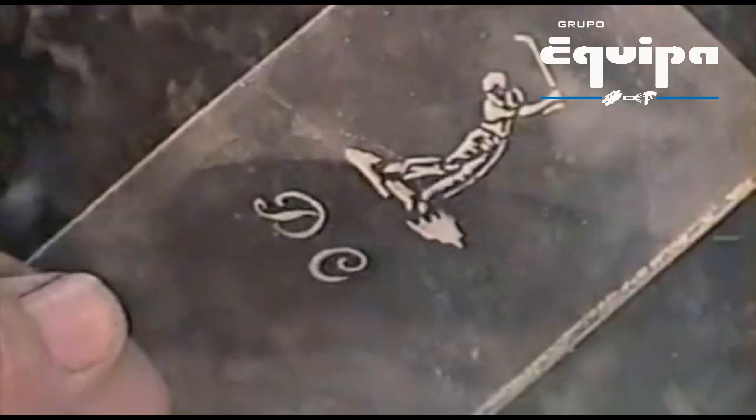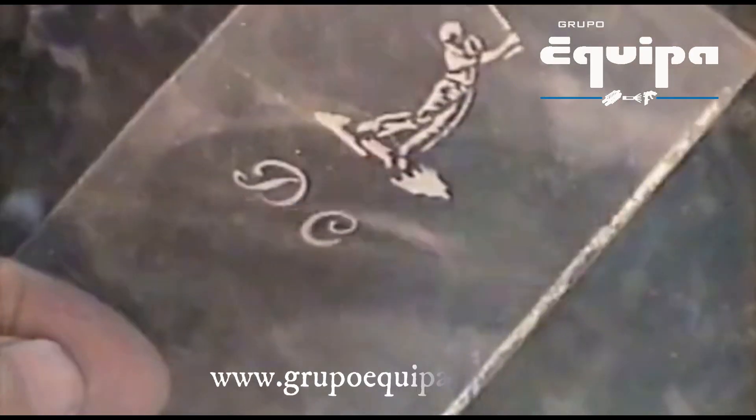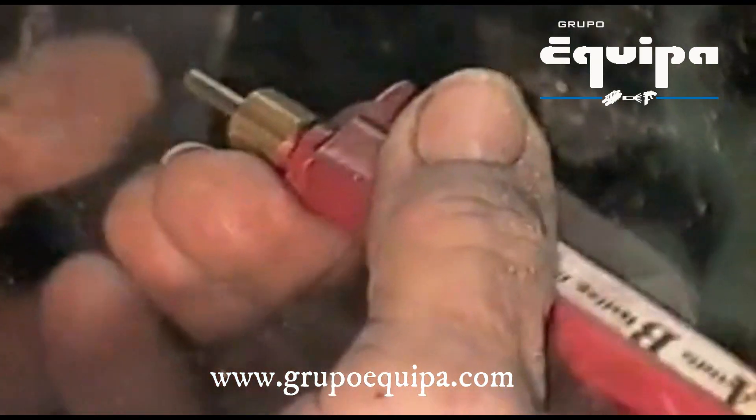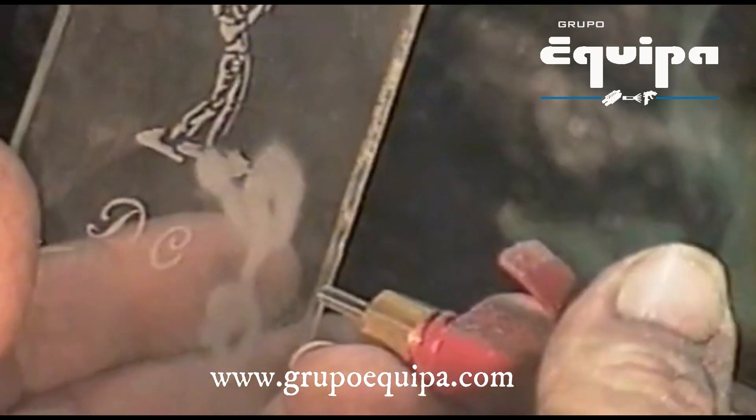Take the stencil off — it's that easy to go in and sandblast. We are sandblasting this at around 18 pounds of pressure. If you're going to blast, all you have to do is push down on the trigger and it will allow you to blast. Let go of the trigger and it stops.